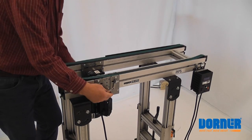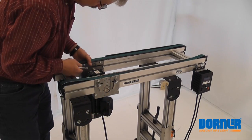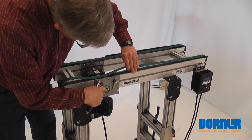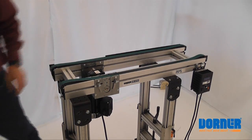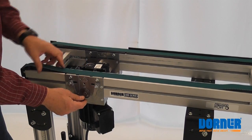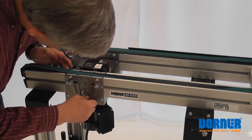You can lift the motor a little bit so the shaft goes through both modules. Using the belt and pulling on it, you can line up the keyway on the drive module with the keyway on the shaft. Now you can take the key and put it in here. If it gets stuck right where the motor is, you can pull the belt and that'll turn the drive module so everything lines up. The key goes all the way in.